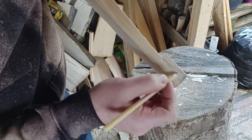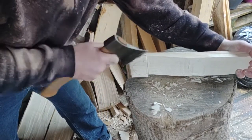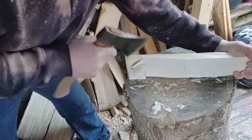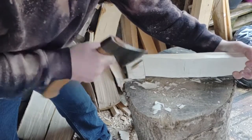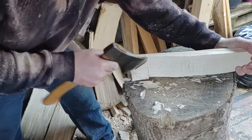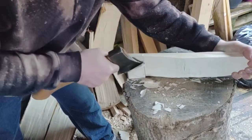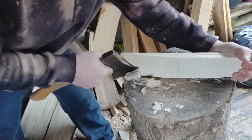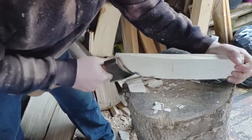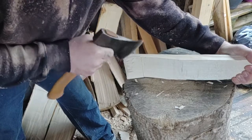This is what I mean about not wanting too much crank in your spoon — the grain length there is quite short, and it gets longer further along. That short grain is fragile and weak, and it'll easily snap off. I'm going to go in down the side, across the grain. Choke up on the axe, get your hand right up underneath the head, and just gently, slowly — don't go mad. You can keep your elbow in and keep the axe striking in the same part of the block — move the billet up and down as needed rather than moving the axe.